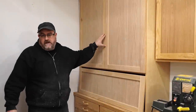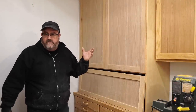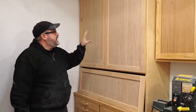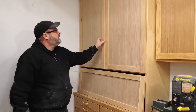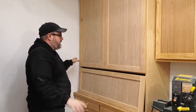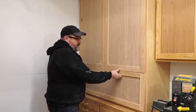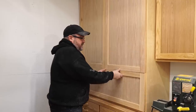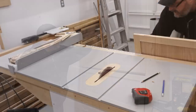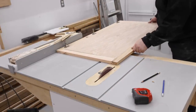Okay, so I put the hinges on the doors and got those installed. I made a separate video about that, a fairly short one, if you want to watch that. The link is in the description. I've got them on, they close, they clear. However, I had to adjust the hinges over a little bit more than I wanted to, because when I compare this door under here, it's sticking out past. So what I'm going to do is take this one off, and then trim like a 1/16 of an inch off the edge. Very small amount.